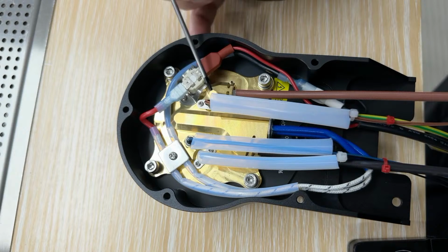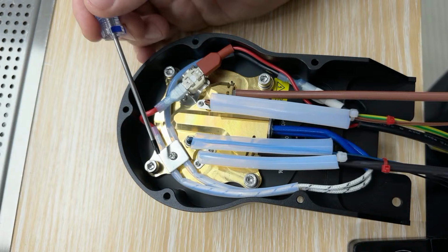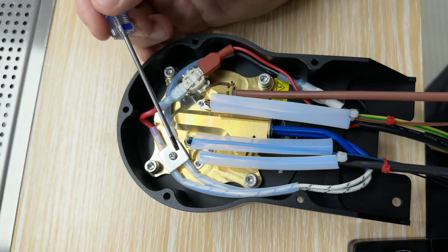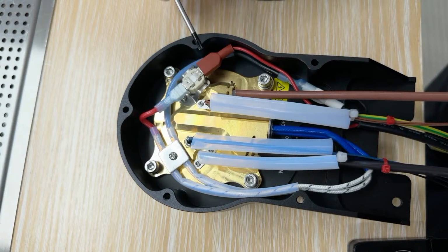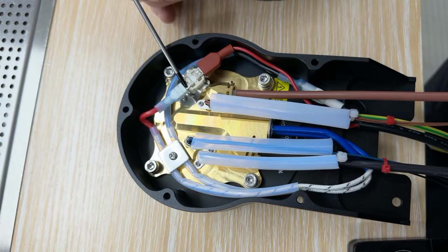We then have some safeties. These are two fuses. The European standard requires thermal safeties that, if they ever trigger, you can't make the machine work again, and they require two of them, so we have that. Whereas the American standard allows a thermal safety which gets reset when the machine cools. So we decided to do all the standards all at once. This is a triple safety. This is a thermostat, which is bolted onto this brass. If this ever gets too hot, then this trips. If this for some reason were to malfunction, then these thermal fuses would trip.